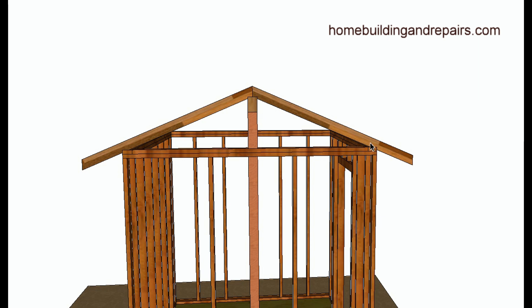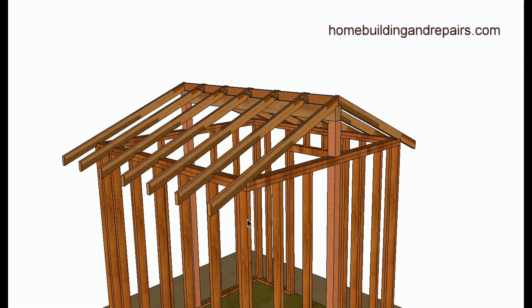With this system, any load on the roof is going to be transferred between the wall and the supporting beam on both sides, so you're not going to have the walls spreading out. The rafters themselves actually help prevent the walls from spreading, because the load transferred onto the rafters isn't moving them down to create a sagging ridge — which would force the walls out — the ridge beam is actually supporting them.